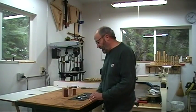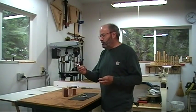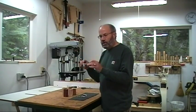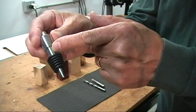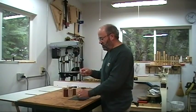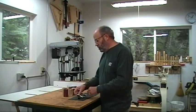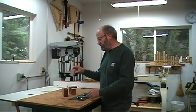First I wanted to quickly go over the tools you'll need to make a bottle stopper. Starting with the bottle stopper kit, which consists of two parts: the metal stopper part and a silicone rubber cork-like part that slides on once it's assembled. That's the part that actually seals into the wine bottle. The end of the stopper is threaded and that will go into a hole that we will be drilling and tapping into the end of our wooden blank.